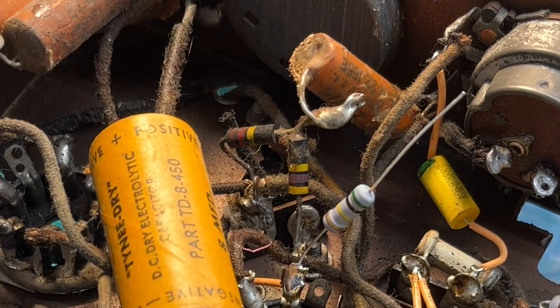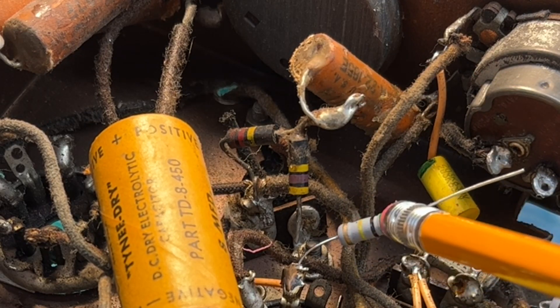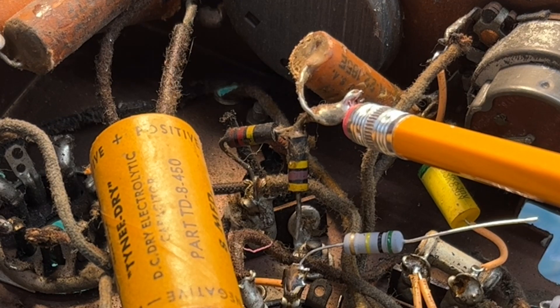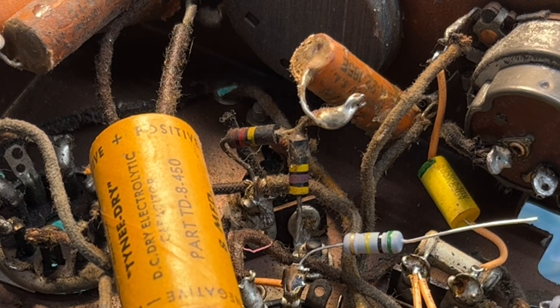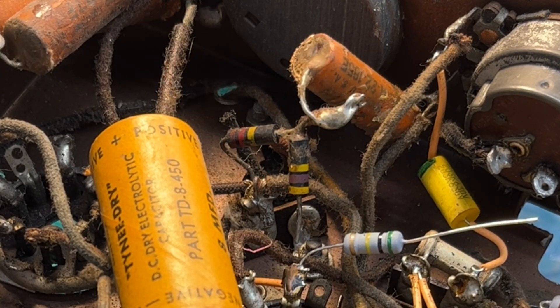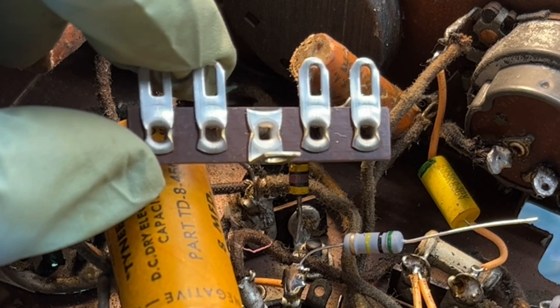Just doing a few recaps and resistor replacements one by one. Check out this configuration. Disregard the new resistor, but you can see the existing resistor 470k and 220k ties right back to the capacitor in mid-air that connects back to the volume control. Seems unusual for that to be done at the factory, but if you look at the terminal strip that was used, that's really the only mounting point they had. So I'm going to attempt to modify a terminal strip and come up with a better solution.